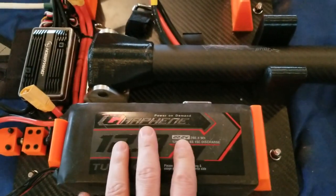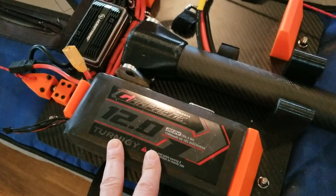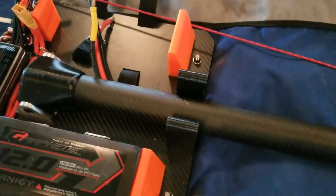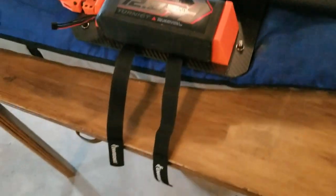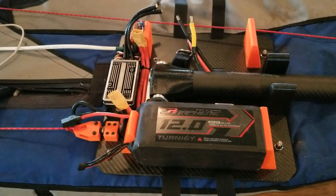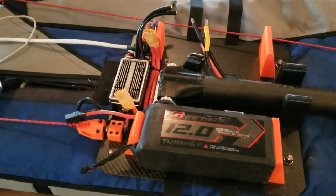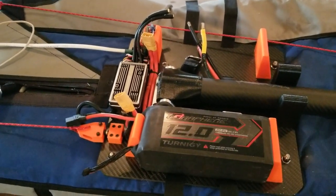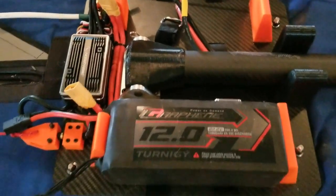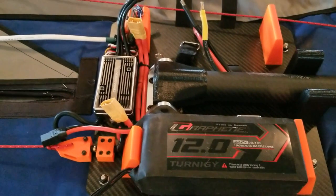You should actually watch some of Radar's postings on the batteries. I initially had them in fireproof bags, but based on his research you're better off to leave them out in case they do flame up — the airflow should bring stuff off the back. He was going with aluminum, specifically not 7075, going with 6061 because it wouldn't catch fire. I want carbon fiber, so obviously these may melt and this stuff could just fall off in the event one of these caught. But I think it's a pretty low risk. Definitely running within the spec of these batteries — they're 15C, probably running about half of what they can do.